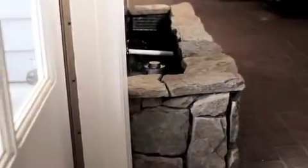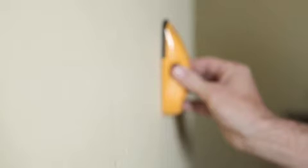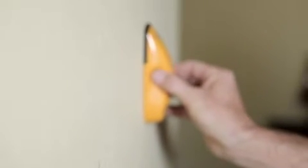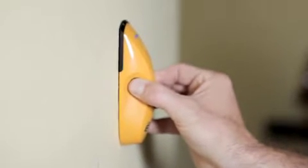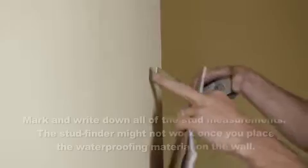This is an interior project, and a small catch basin has been built to divert the excess water to go outside. Before the panels go on the wall, we must find the locations of the studs and anchor to it. With a stud finder, mark their location.